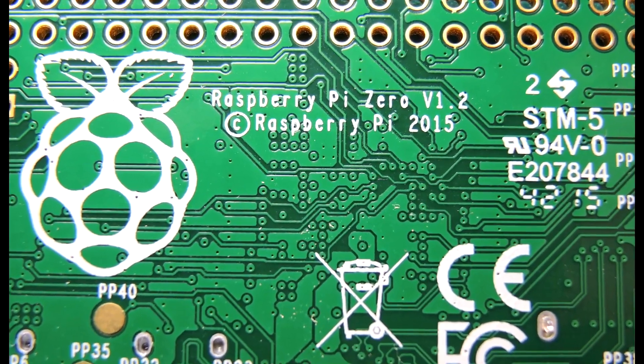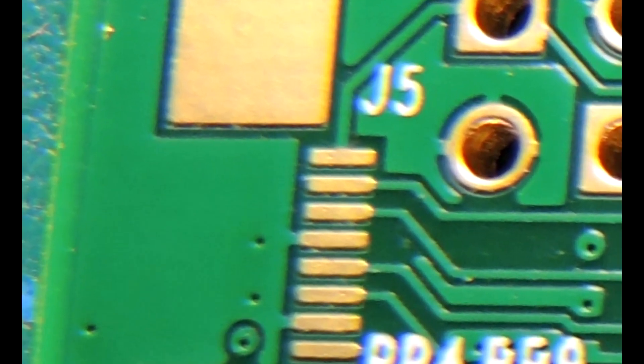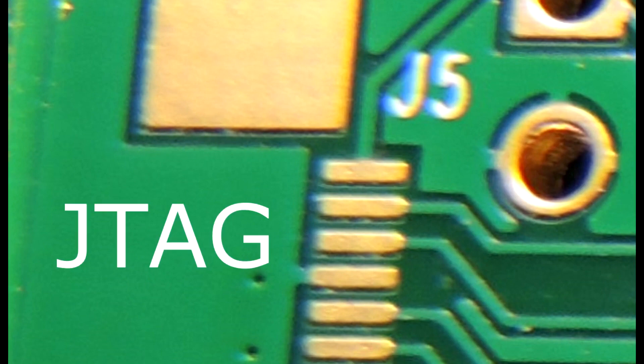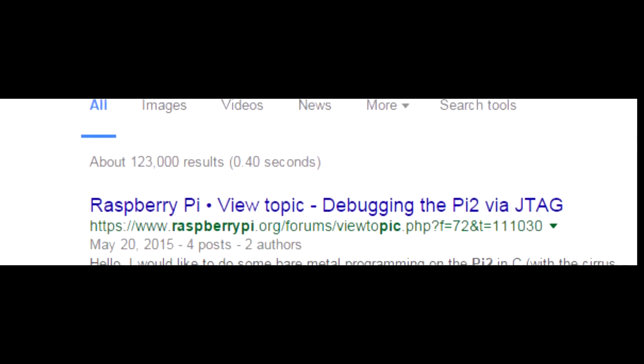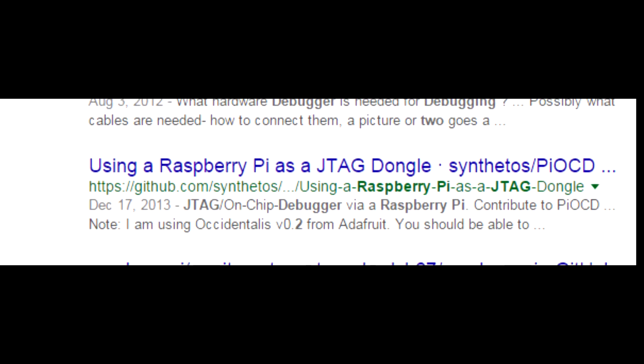Here's the whole back view. On one side there's a connector that's not populated because it's not normally required in operation — I'm pretty sure this is the JTAG connector. JTAG stands for Joint Test Access Group, originally a protocol for testing that circuit boards are connected and soldered properly, but later much expanded. It's probably the prime interface for accessing the CPU on the integrated circuit. JTAG debuggers allow you to single-step through registers and look at absolutely everything — very powerful for bare-metal embedded software development.